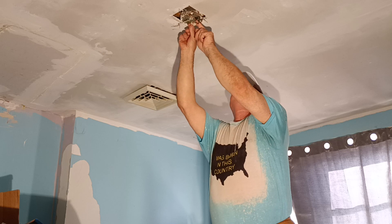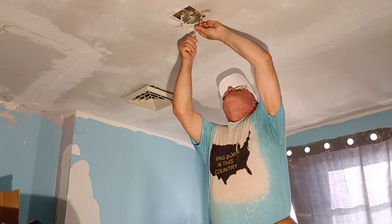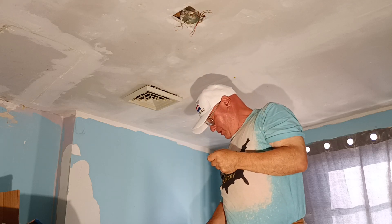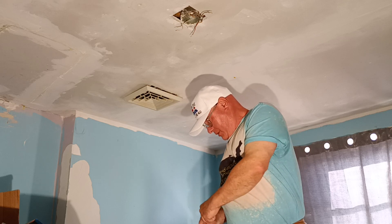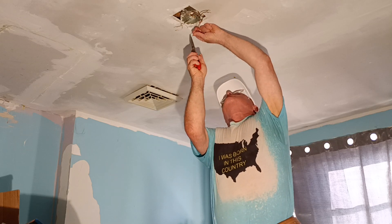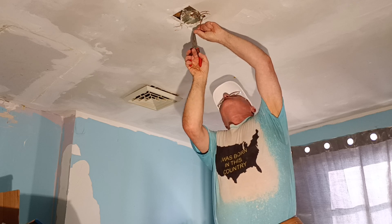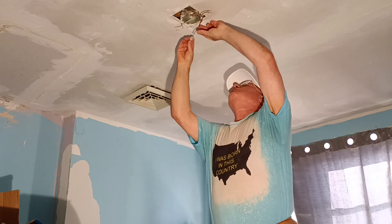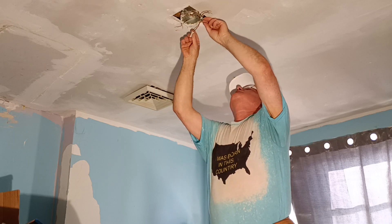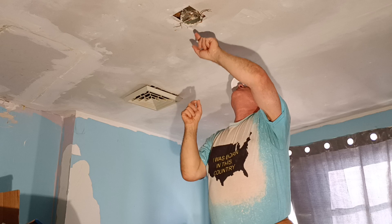Here's our red wire — this red wire was capped off and it's not being used here, so we'll just make sure this wire nut doesn't come off. What we're going to do is fold this wire over a little bit so that the wire nut grabs it a little bit better. Fold it right over so that the wire nut grabs everything better and stays in the wire nut, so there's no chance of it coming off. Our wire nut goes on there nice and tight. Now we can fold this up and get it out of our way and into our box.